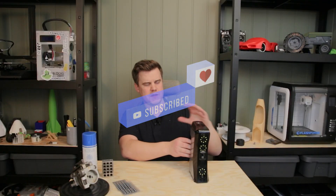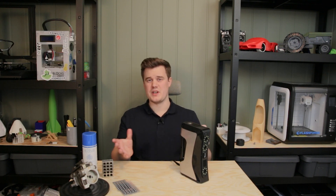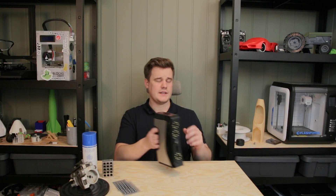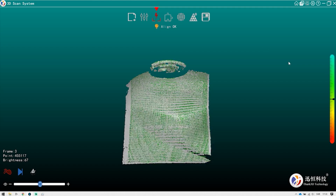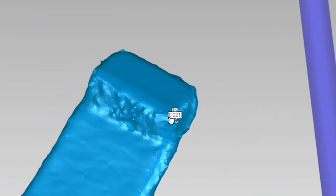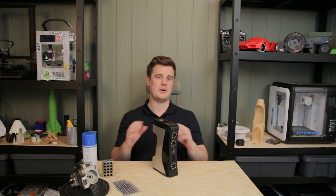Let's first look at some of the specs. This is a handheld structured light 3D scanner designed for capturing objects of around 20 centimeters up to 2 meters depending on how you're using it — you can always go bigger or smaller. It features a dual field of view mode, letting you focus in on smaller objects or cover a larger area for tracking larger objects. In optimal scenarios you're getting around 3 million scanning points per second with an end resolution of around 0.25 millimeters in the mesh, and overall accuracy should be below 1 millimeter per meter.